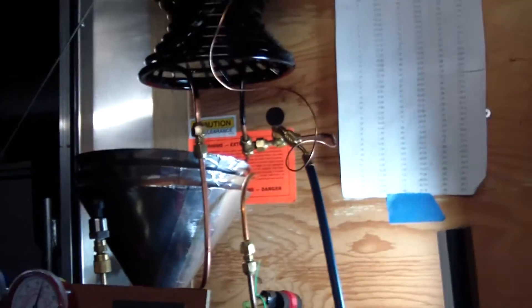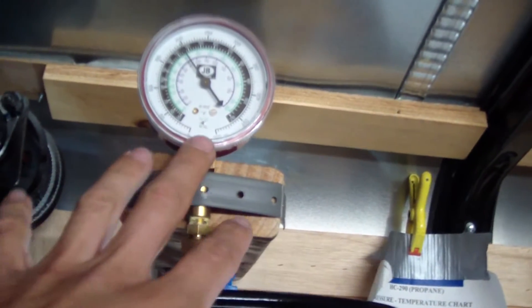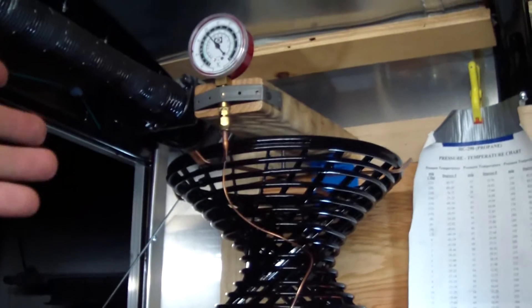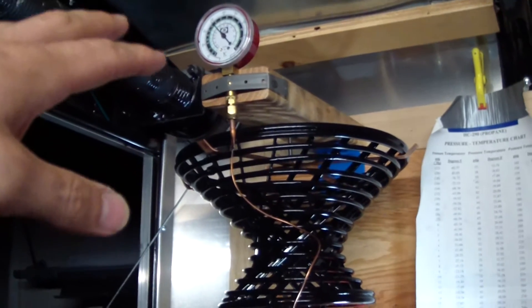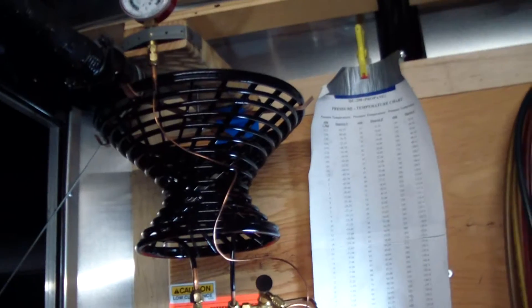What I'm going to end up having to do is just return to a static condenser, and I'm comfortable with that. By the way, there's also a pressure gauge on the thermosiphon, so I can read the saturation pressure and temperature in that cycle, which I presume is essentially the average temperature between the two coils. The more liquid I put in there, generally the higher pressure it exists at and the more heat transfer I get through there — just one more metric to understand the system.